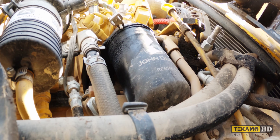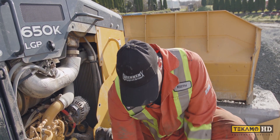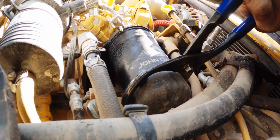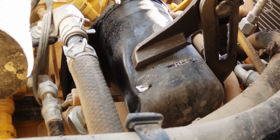To change this filter and crack it loose, we can use filter pliers, we can use channel lock pliers or pump pliers as some people call them, or we can use a strap wrench. I've already tried the two pliers. The person who put this filter on before me made it very tight, so we're going to use a strap wrench because it's too tight to get off with pliers.